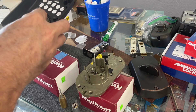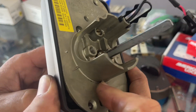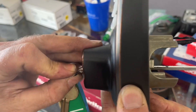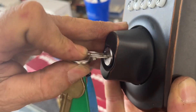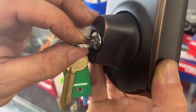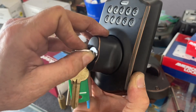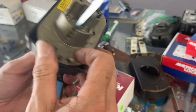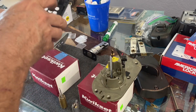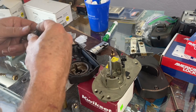What happens is: because the five-pin cylinder is short, when you push in on the cylinder it lets the tailpiece engage. Since the six-pin is too long, it's just not letting it engage. You could take the key and turn it to get it into that position, but it will always be in the unlocked position. When you try to turn it back, it's so long that it won't — and this is keyed up to a blank key. It won't let me turn it back to remove the key.